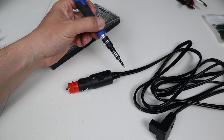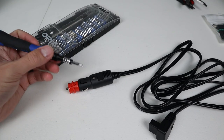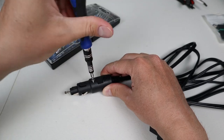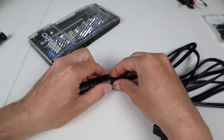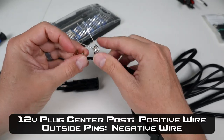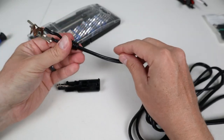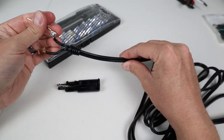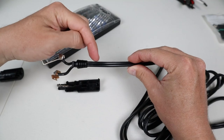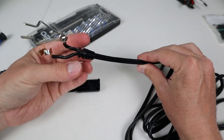The first step in modifying this cable is finding out which is the positive and negative wire, because they're both black and it's sometimes hard to tell. What you want to do is disassemble this connector - twist the end and pull it off, unscrew the screw, and it snaps apart. You can see the center connection goes to one wire and the outside to the other. The center post is the one with all the writing on it, and the negative is the one with ridges. The ridge wire is our negative wire.